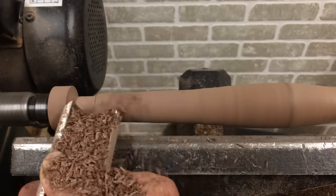The last step is to fit the tenon. I made these slightly larger than what they need to be - there's nothing worse than doing a turning and having a loose tenon - so they're a little bit fat and done that way intentionally. What you can do is use a knife and trim that down and get it to fit. You can see where that was done on the existing one - I just need to line up the two parts, put a line here, and trim that all the way around and progressively fit that. I find it's best to use a carving knife because you can scoop and then cut - that's really recreating what was done on the original piece. Just fine-tune it with sandpaper, and then give it a test. A nice tight joint.